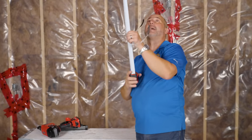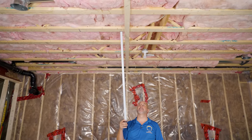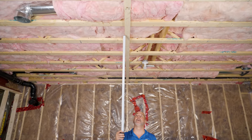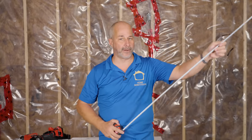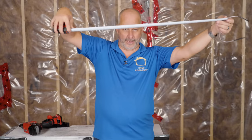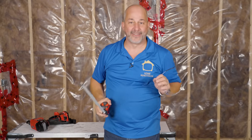Second benefit: look up here. Every time somebody steps on this floor joist spanning 20 feet, if you put strapping on it and nail it, every time they step on it, load transfers from here to here and from here to here. That means your floor is now three times as strong. Upstairs they've got engineered hardwood nailed in place, and every time you walk on it and it deflects, all of those nails get a lot of stress. It starts to pull apart over time from the hardwood and the OSB subfloor — that's where squeaks come from. It's not going to happen in the first week, but it will happen in the first couple of years. By the time you get 20 years in on a brand new build, if it's all squeaky because of deflection, you're going to be tempted to spend more money where it wasn't necessary. Add strapping — stretch out your deflection from all the foot traffic and extend the life of your flooring.